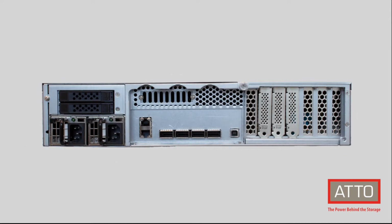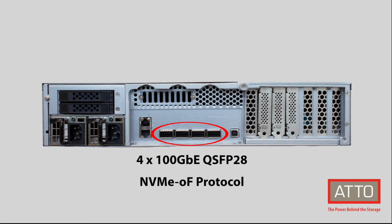Now, onto the connectivity side of the controller. Most importantly, you'll notice 4 Ethernet ports at the center of the controller. These are 4 independent 100 gigabit Ethernet ports that deliver full performance via our non-blocking switched architecture. Network connections are standard NVMeoF protocol. Inside the box, every port can access every drive without performance penalties.